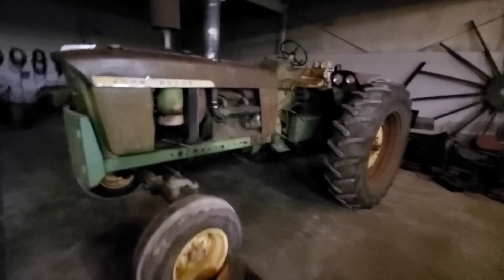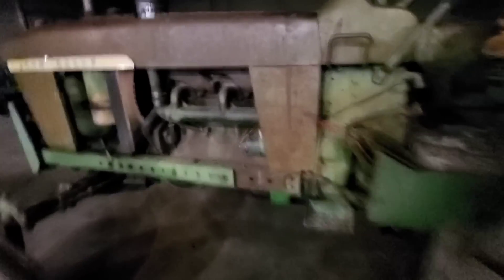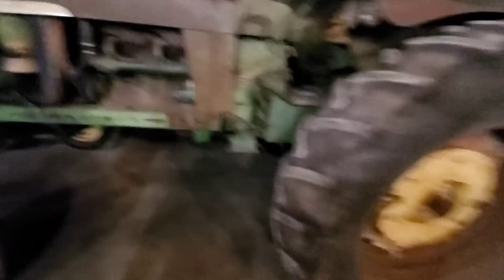As a conclusion to this video, here's another 4010 that showed up. We've got to rebuild the front end on this one. It's having a hydraulic pump issue — I already checked into some stuff and took the side screens off. Once it gets hot, the three-point won't even lift or really produce any power. I'm thinking it might be more of a scavenge pump issue than the actual front hydraulic pump. Pretty straight old tractor — just needs paint. It's got 16.9-38 rears, and it is an original-paint tractor, actually. There isn't much paint left but the metal is very straight, and those are original decals. He also wants a new seat put on. We'll get her cleaned up, rebuild the front end, and go from there.